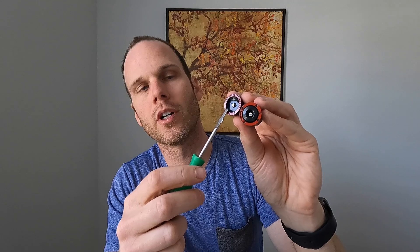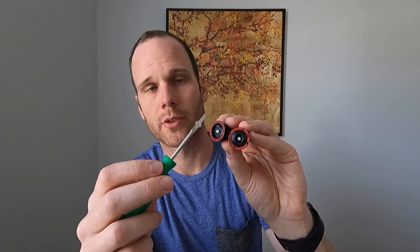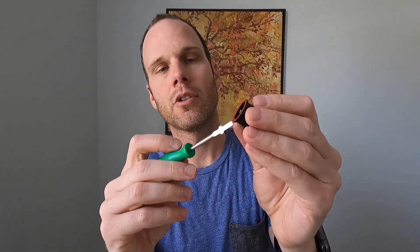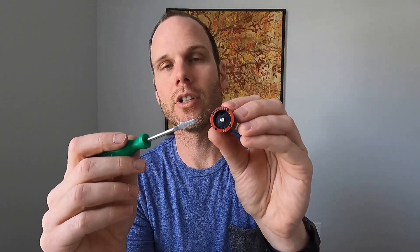On the half nozzle, you have dash marks up here — those mark exactly where it's going to spray out the water. You can see the slit in the front where the water comes out, and the dash marks line up with it. So when you're adjusting that sprinkler head, from the top view you'll see exactly where that 180 degrees lines up. The last one is a 5Q — the Q stands for quarter, or 90 degrees. Those dash marks show the 90-degree spray area, with a little port for the water.